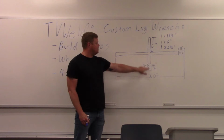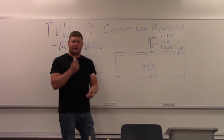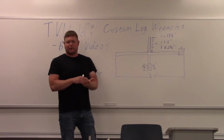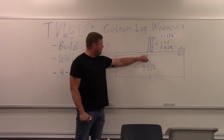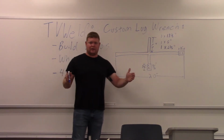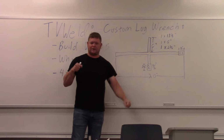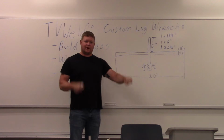So with 6 inches of probably solid rounds. You want solid rounds, I would assume, because you're going to end up spinning this in your hand. You don't want square stock or it's going to catch, right? So the American made one I want coming off of the 20-inch bar, because with 20 inches I can torque that, right? So you want the better socket in there so you don't break the socket, right? So I'm going to use that as a breaker bar, if you will.